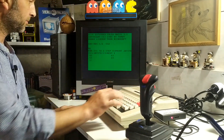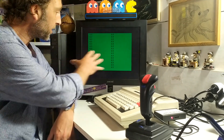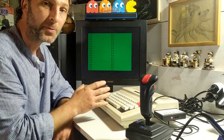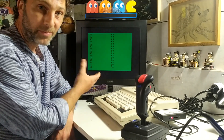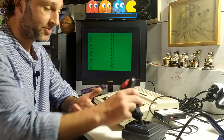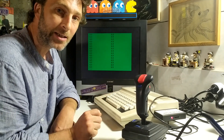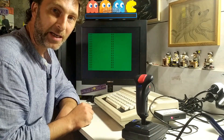Running the program, we're seeing 63 and 63 scrolling down the screen — one line for each axis, X and Y. We should get 63/63 pushed down-right, 0/0 pushed up-left, and roughly 31/31 in the middle. But as you can see, it's doing nothing at all, because it's wired up wrong. So we're going to open this up and do the mod in about two minutes.